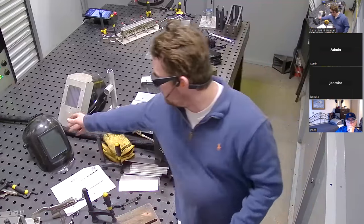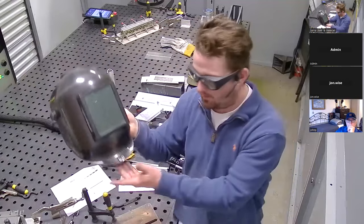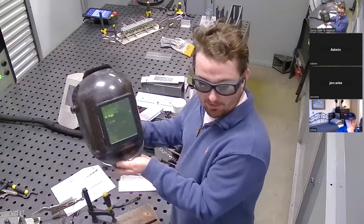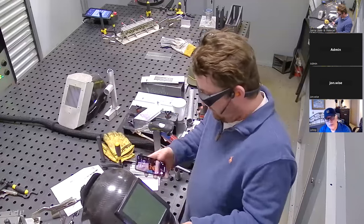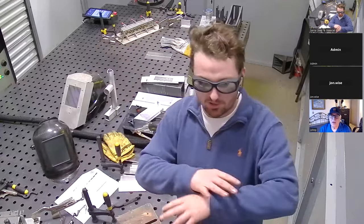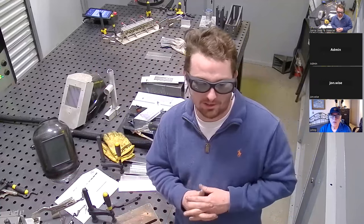That's why the shade of the hood is only a 3. It's not very dark because the weld is not very bright. So there is still the risk of skin cancer and sunburn, but it's much, much less. It's more about the eyesight safety here.